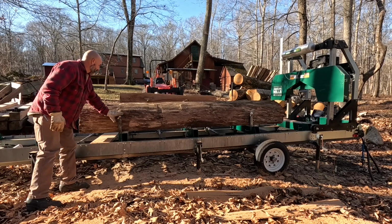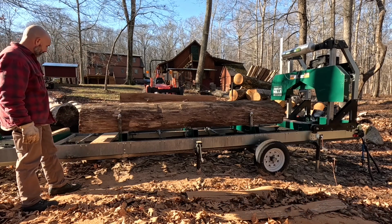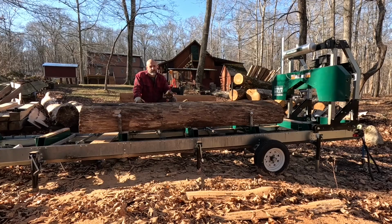Just checking the heights in these things. I don't want to cut these wheels. You know what I'm saying? So I'm kind of just thinking on the run here. If I'm building something that's 8x12, I really only need like a 4.5, 5-inch beam. So I'm going to cut this thing into a decent cant and see what I can get out of it. If I go 5 inches, I need 2.5-inch stock and 5-inch stock. I'll probably end up going 5 inches with these. And then yeah, try out the tools on those. All right, 5 inches it is.